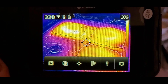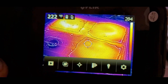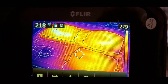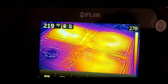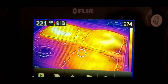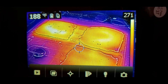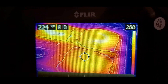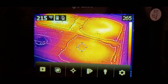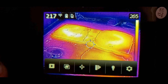These beads are actually designed to go into paint, and adding them into paint creates an incredible thermal barrier. Another way to increase the efficiency is to get bigger ceramic beads — these are really small, almost powder-like. They come in different sizes. Also, these ceramic beads aren't just ceramic — they're actually a sphere with a hollow vacuum inside. These tiny spherical ceramic beads with a hollow vacuum create the thermal barrier, and you can add them into paint or, in my case, into a stucco mix as a final coating on the dome. Anyway, this is Ickrey Harry — peace out, catch you later.